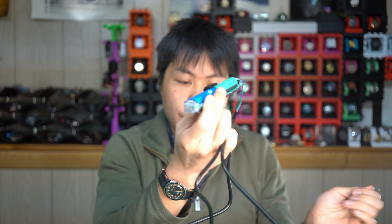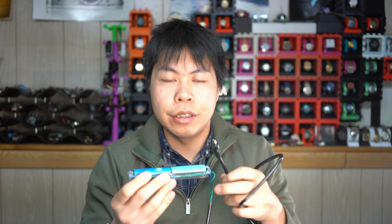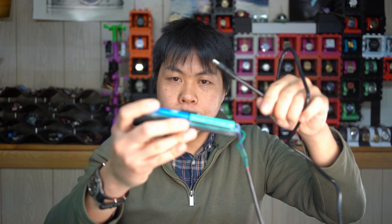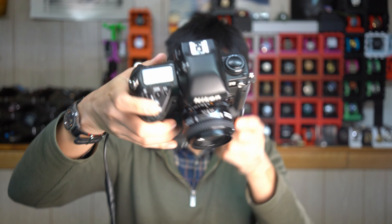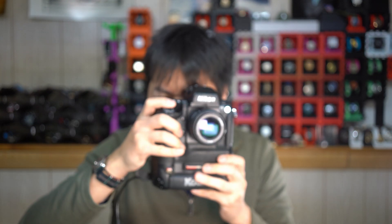Most of these are already going to be arranged so that the center is positive. And if you need to verify that, go grab a multimeter and do your continuity checks. But once you have it wired up that way, all you need to do is plug your male end of the barrel jack into your female end of that adapter, and plug it in to the camera. And here we go — good to go.